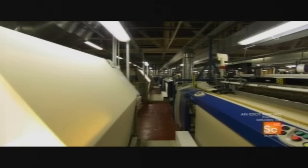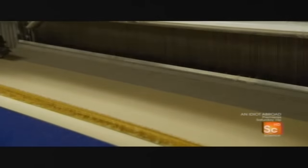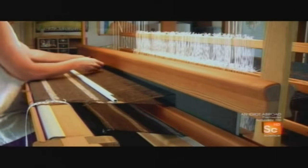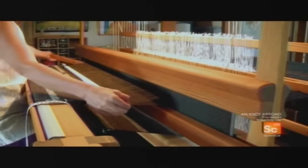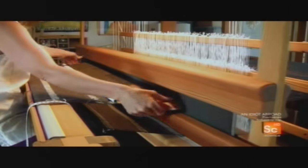But how does this machine get its speed? To manufacture massive amounts of fabric in a cost-effective manner, the loom needs to move the weft through the warp as fast as possible. Old-style looms use a shuttle, which is a spool of thread that unravels as it's moved manually back and forth. Shuttles are reliable, but slow and in constant need of reloading.